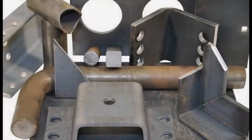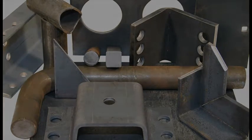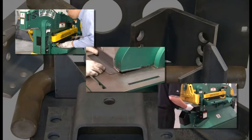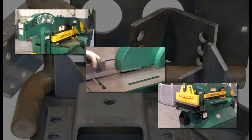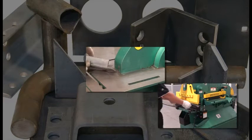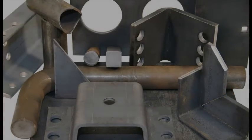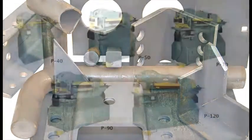Operations. Mega Manufacturing builds 5 separate models of its single-slide hydraulic ironworker. A single-slide ironworker utilizes a single hydraulic cylinder to provide power to all workstations. The single-slide Piranha models are designed for safe operation by one operator only. Do not allow more than one person to operate the machine at the same time. Never attempt to exceed the rated capacities of the machine. Refer to your owner's manual for workstation specifications.